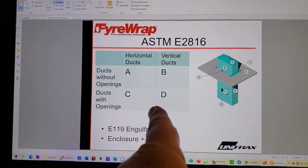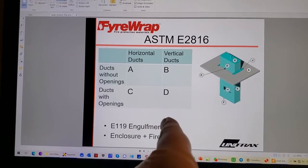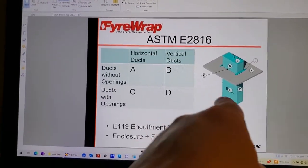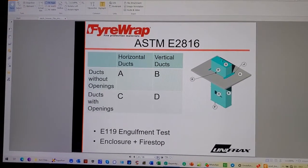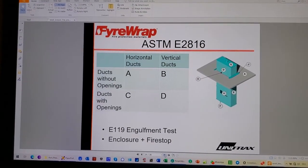And compare some listings, certification listings with through penetration fire stops for smoke exhaust ductwork and how they can do that. One of them actually puts, it's smart, a damper inside the through penetration, because now you've got some stiffness. There are issues with dampers as well. I've made that clear in another video.